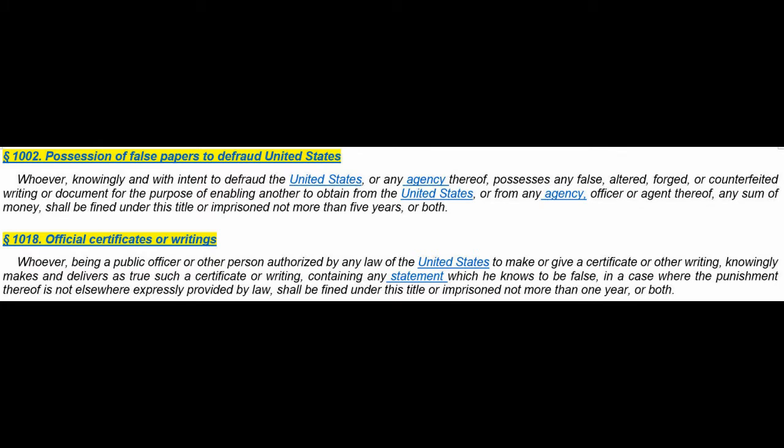So that's the question. Are you creating a standard collectively that then results in test reports and certification listings that are misconstrued to provide a life safety function in a building, to provide fresh, cool, breathable air to victims of a fire inside of a building? They want to be able to egress and breathe, or they want to be able to hunker down in an area of refuge and breathe. Not with superheated gases, or just be there and nothing arrives because the fan is toast because the fire happened to be outside of the portion of the duct where the fan was located, right? And the standards don't talk about the fans, but that's the purpose of the whole thing.